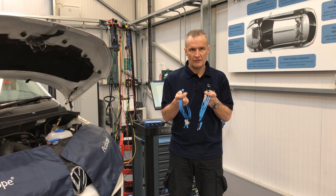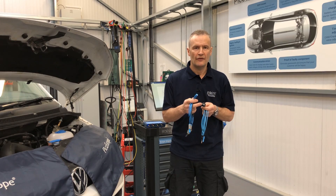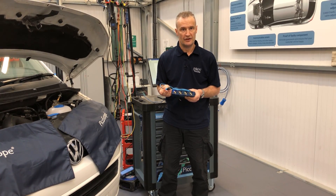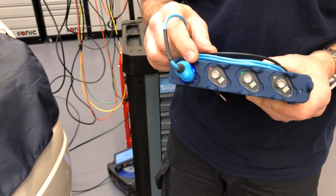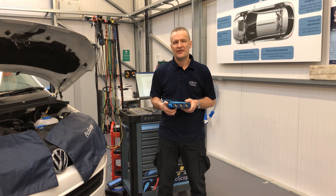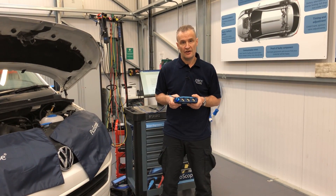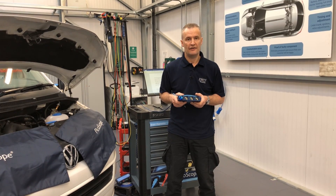Nothing changes in terms of how the signal enters the scope via these test leads — new and old will still fit the 4425A. The BNC plus times-one blue test lead still utilizes the conventional BNC for the signal, but with the additional six pins on push connection, the blue shell is indicated with a blue LED all around the input. BNC plus reduces setup time and errors: we don't have to worry about the probe menu — push-fit BNC plus and the scope recognizes the probe, amends the software to times-one, and zero offset is taken care of.